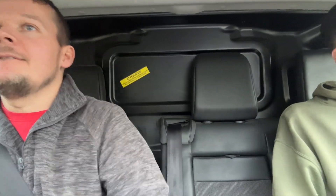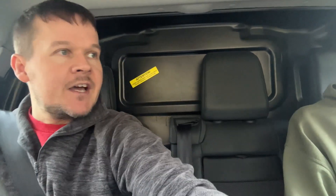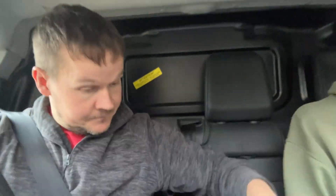Look at this — we've got to go and replace a 45-amp double pole switch that is on an immersion. It's an industrial immersion at a beauty salon, which we've got to go and replace. One of the neutrals is loose, so it's burnt out.